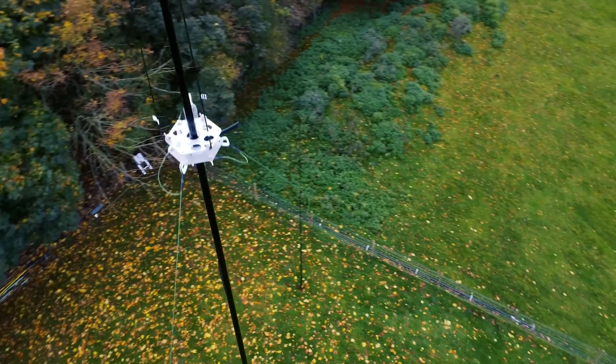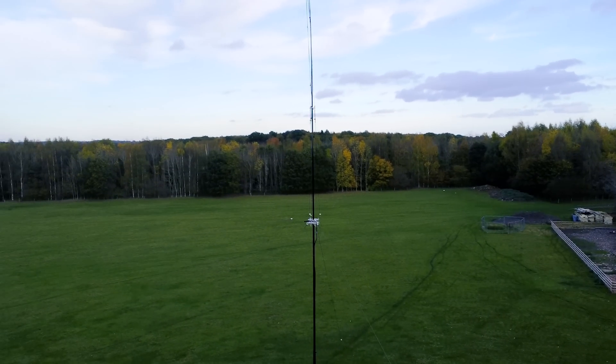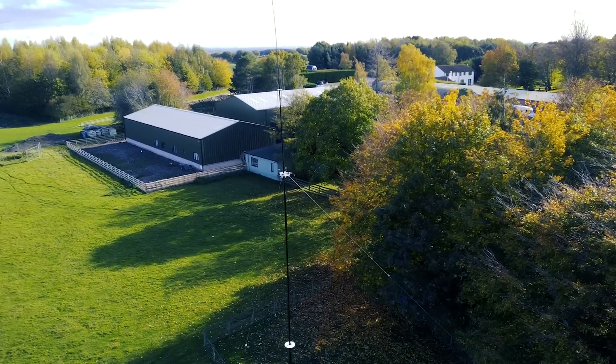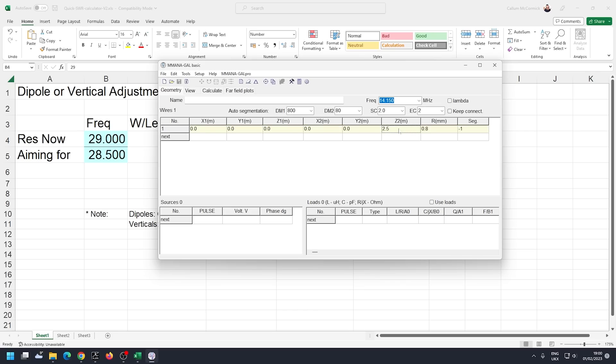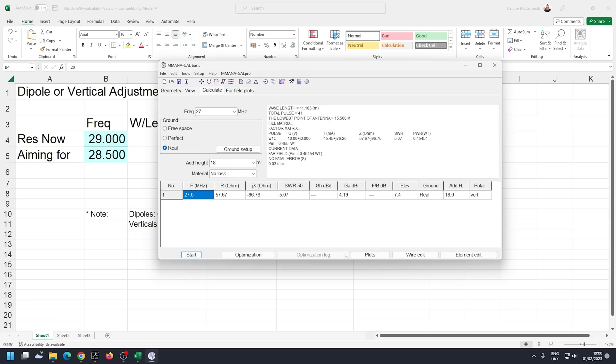Science is easy when you know the basics. I encourage you to try things like this — it was a great little antenna. It took the idea of the Skylab Star Duster and turned it into a tribander for 15, 12, and 10 meters, which with the sunspot cycle coming out could really sing. I modeled it at about 16 meters high — that's 18 meters minus 2.8 meters — which is roughly 1.6 wavelengths off the ground on 10 meters.